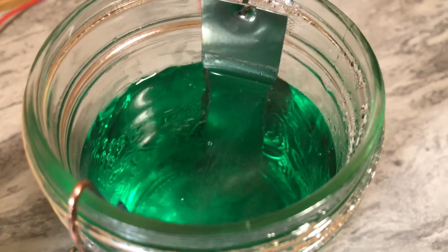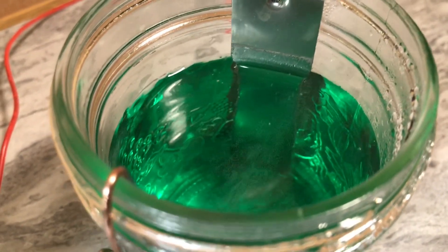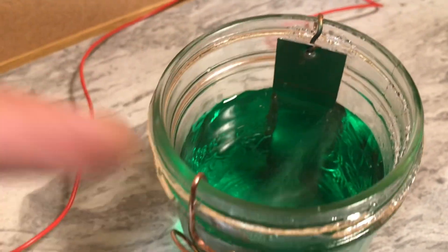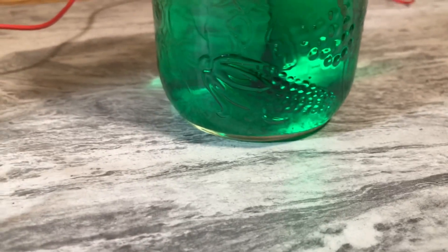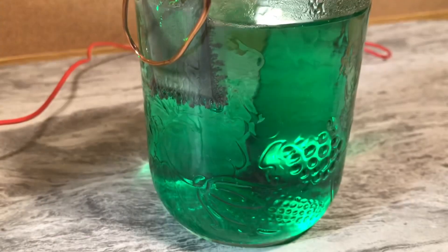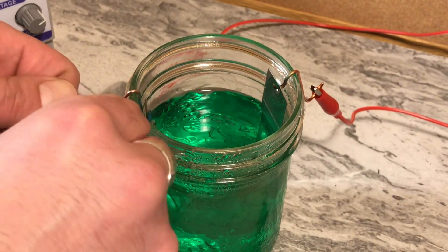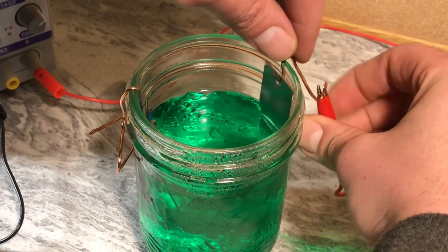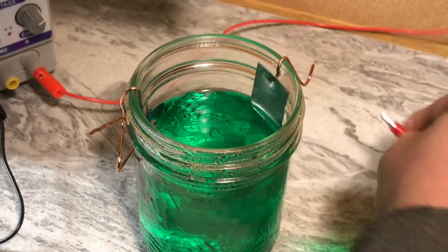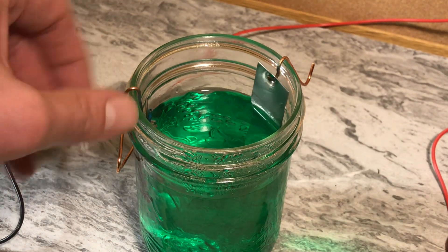We now have a nice dark, rich green color. You can see how much the nickel anode has worn down — the sides have been eaten off. What's happening is the nickel is transferring from the anode over to the cathode. You can see the black specks I mentioned on the cathode, but those come right off, and some fall to the bottom — that's why we filter it. The nickel plating solution is finished after cooking for two hours, giving that really nice rich color.